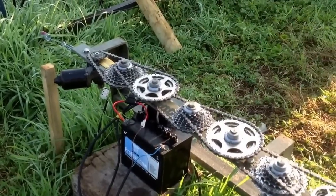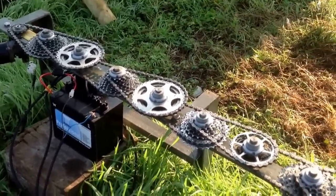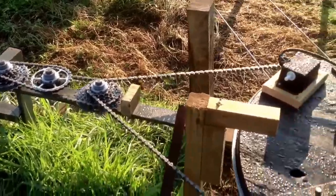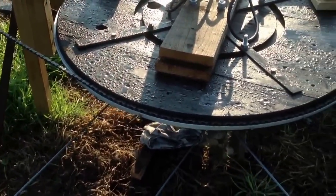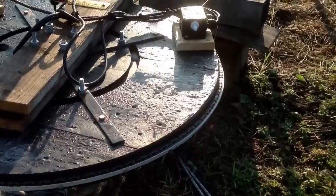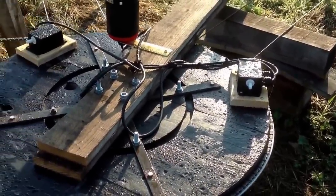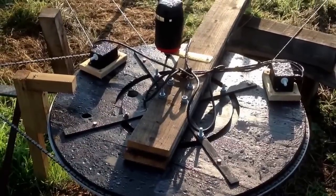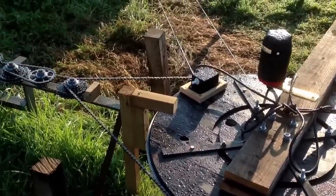The drive ratio starts at 50 rpm, and by the time it's been reduced through the gearing system right down onto the final gear — which is this wooden rim, where the cable is fixed at a point at the far end underneath that post — we've got a reduction such that the whole assembly takes about 25 minutes to go from east to west. At the moment it's working extremely well because we've got a lovely bit of sunshine.